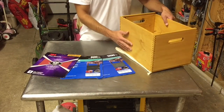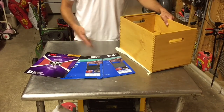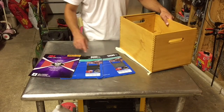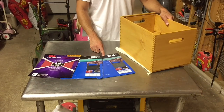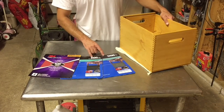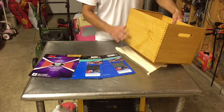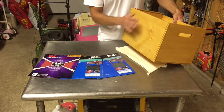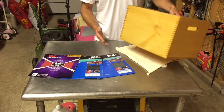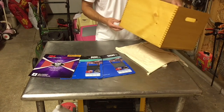Once my polyurethane has dried for at least 24 hours, I do my final sanding. I start with 400 grit, then go to 600, and finally 1,200. The 400 I get at Home Depot; the 600 and 1,200 I've been getting at Woodcraft locally. This 1,200 grit is like furniture grade — if you step up correctly, it is going to be so smooth you won't believe it. You're taking an $11 piece of wood and turning it into something really nice.